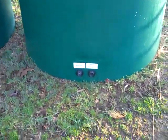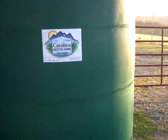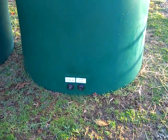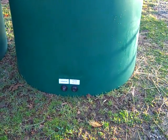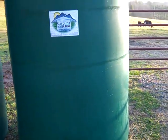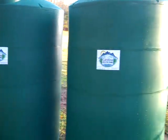You can see we've got water outlets and overflows. In a lot of the situations I install, I have those gentlemen put in an overflow pipe that comes up inside as a standpipe, so nothing plumbing-wise is exposed. I will bury the front end of the tank where the plumbing goes in below the frost line, so you don't freeze the plumbing. These tanks won't freeze — there's just too much volume — in most places in the United States. Carolina Water Tanks are great for backup water systems.